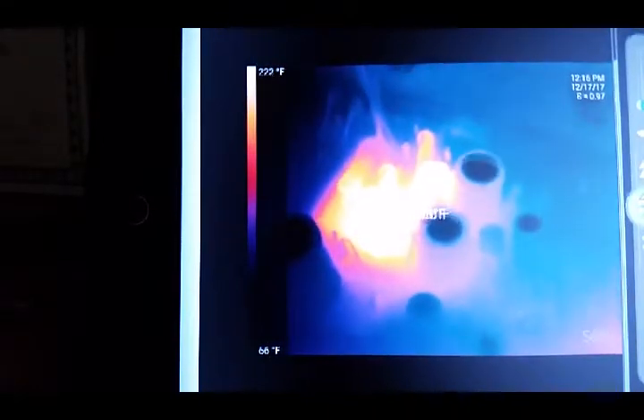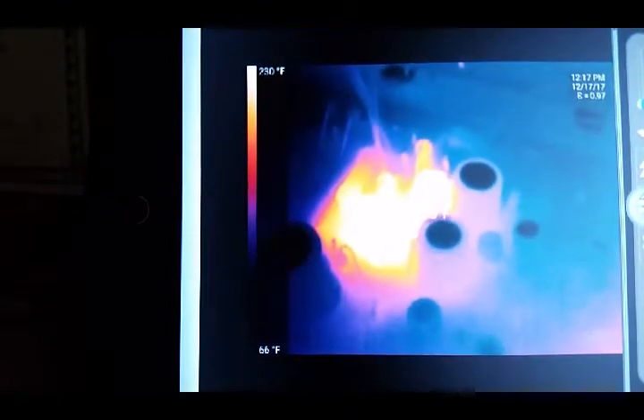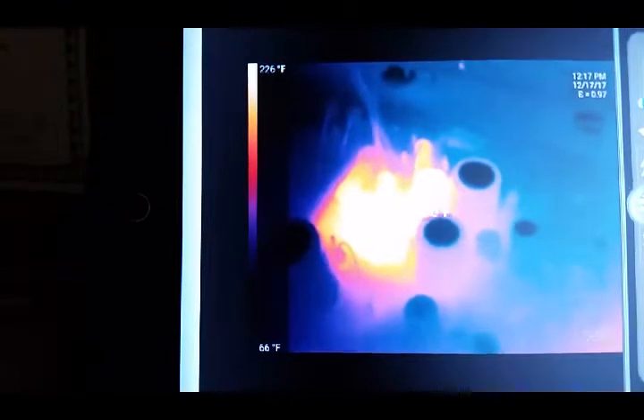You can see that this whole area is very warm. Right now we're looking at a resistor that's almost 200 degrees — 220 degrees. It's being overloaded because of the failed transistor on the right channel. The transistor itself, or a different transistor part of that same channel, is at about 120 degrees right now. Because of the overload they're running much warmer than they should be.